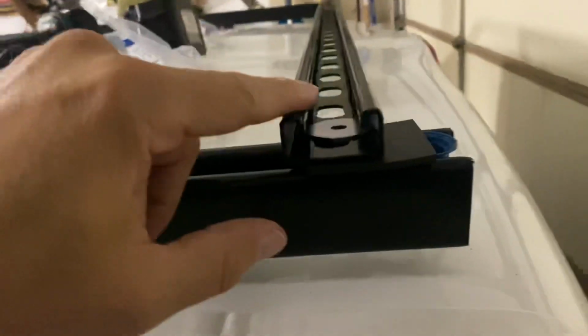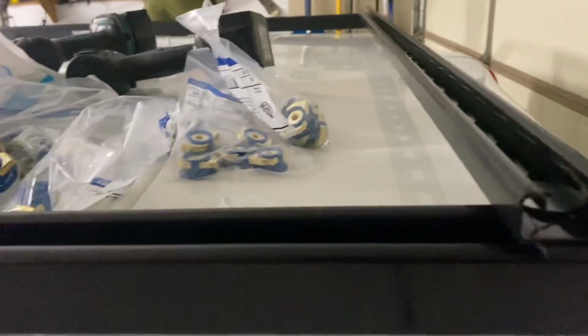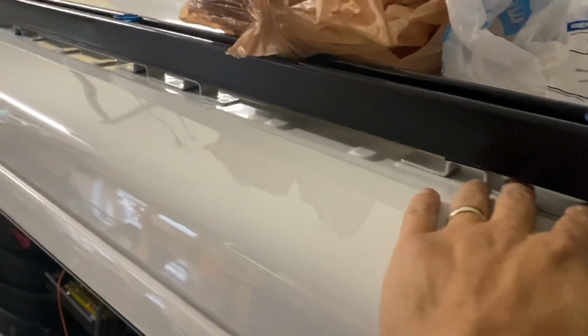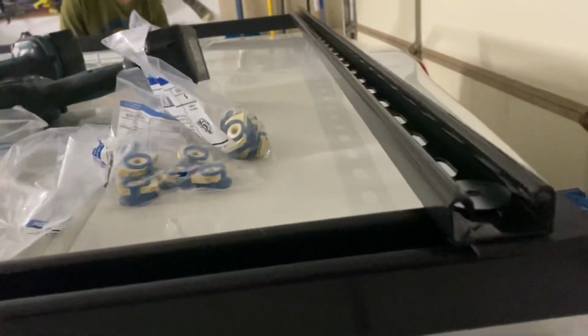So you see, this is 5 foot long, this unistrut, and if you can tell, this unistrut is not nearly as thick as that one, but it's plenty strong. And these are 10 foot long, and I just cut them in half, and they fit perfectly right across, because the things on the van are 5 feet wide. And so if you cut these in half, they'll fit right across.